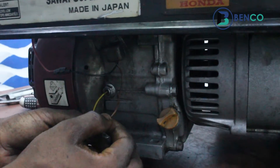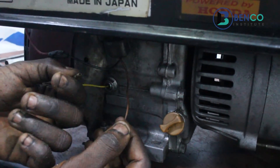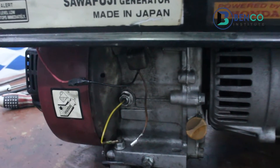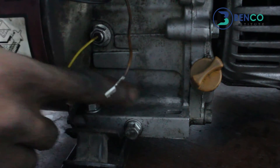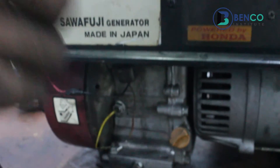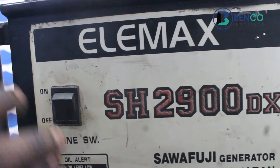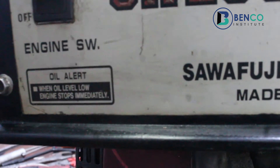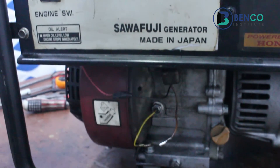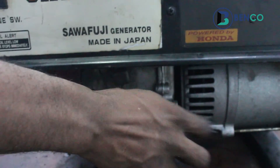You disconnect. This wire — this is the connection between the oil sensor and the oil switch. When you connect it back, it's functional; when you disconnect it, it's not functional. So what do you do? You disconnect. When you find your engine with oil in it and it still gives you the going-off sign at regular intervals even after the gen is on, that tells you your oil sensor is bad. Before a technician comes in to look at your gen, you disconnect it.